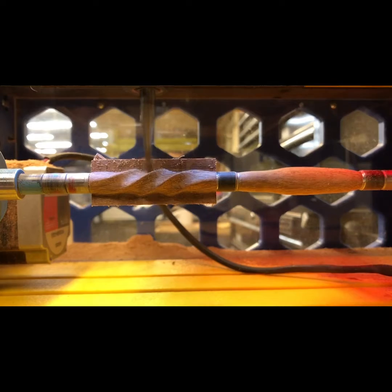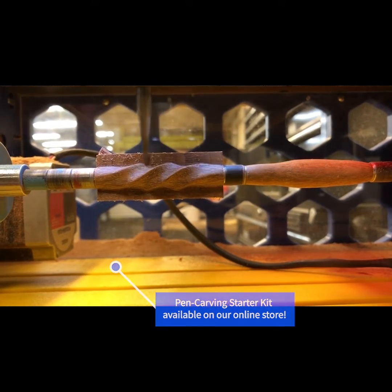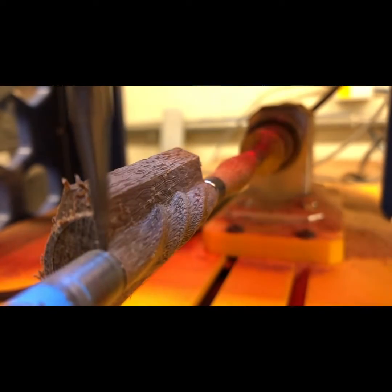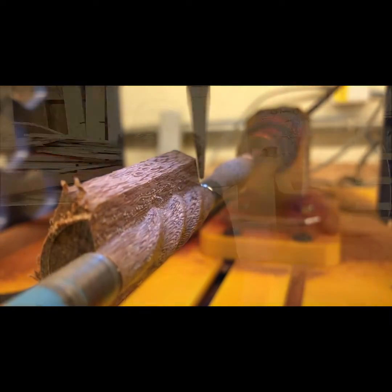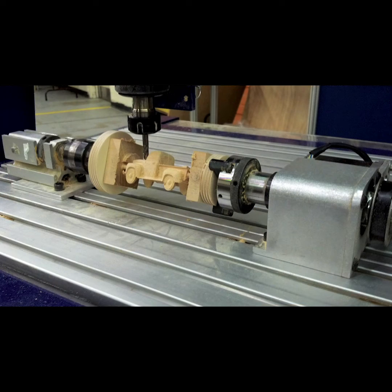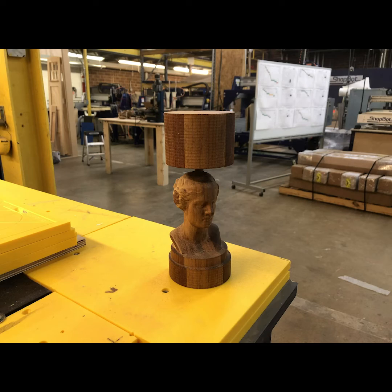The indexer is really just another tool in your toolkit. There are a lot of people that do pen and pencil turning traditionally — they make pen lathes, and a lot of that is done with interesting materials, unusual acrylics and different kinds of stuff that make a really unusual-looking pen or pencil. I do a lot of fat-leaded shop pencils. You can turn the same kind of shape you do on a regular lathe, but you can also wrap text around it, do chip carving patterns, inlays, or add recesses for fingers. So the indexer is just another interesting tool to add into your CNC toolkit. Let's do it.